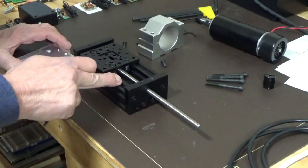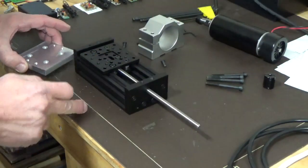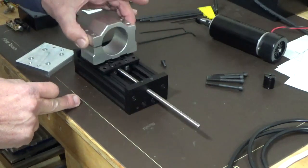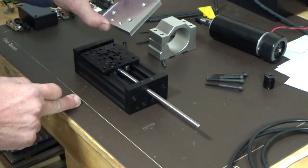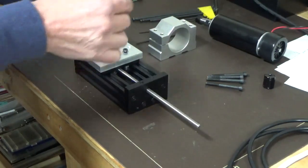What we have here is our aluminium extrusion. This is adjustable up and down using this drive here, and the face plate on this is not allowing us to fit the actual motor on, which is just slightly wider. So what we had to do is make up an adapter plate, and that's the reason why we had to countersink all the cap head screws.